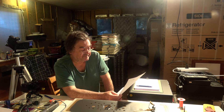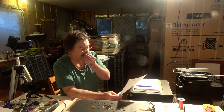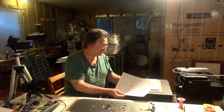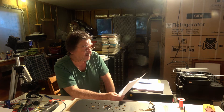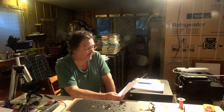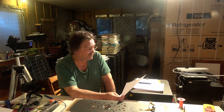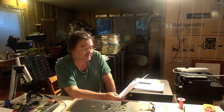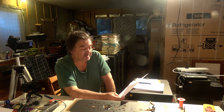All the other panels I have are all over the place. The measurements for most of the early ones are fairly low — in the 30 to 70 megaohm range, averaging around 47 to 58 megaohms. The new ones seem to have an average of about 150 megaohms, which perhaps is ideal or as it should be — my average for those comes out at 133 megaohms.